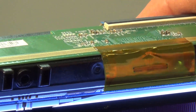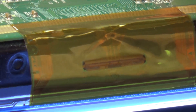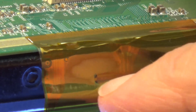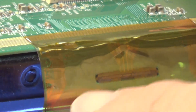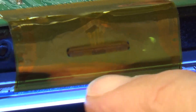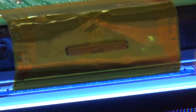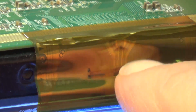If we get a close-up of what's in these tabs, this is actually the drive IC here. If we look through the tab you can see the actual drive IC on there. This is an IC that's underneath here, put on with what's called a hot bar technique. It passes the signals from the timing controller — these are the inputs here — and all the outputs from the IC go around and connect down to individual connectors that basically drive each line of the actual panel. I think our problem is this IC itself — it's not making a connection, it probably got severed when the TV dropped.